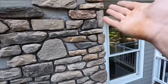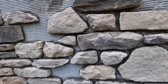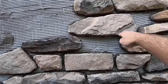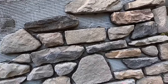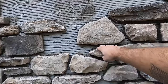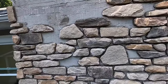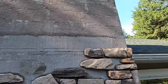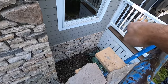You do one corner, then the other corner, and then fill in the guts. You just build leads, stepping down like that. Every one of these rocks has a level part — I'm trying to have the top level. See how it's slanted here but the top's level? This one is a circle but the bottom's level. I always have one level section on my stones. Then: corner, corner, level mark across, fill in the guts — that's about it.